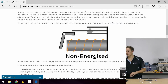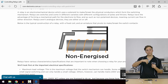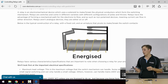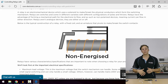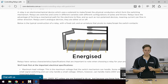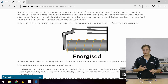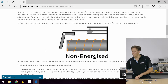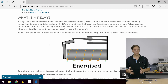A relay uses that principle - you can see a working description in the tutorial where the coil is energized and it has an armature which is attracted or pushed away from the coil depending on how it is set up. When it's energized it will make a switch, and when it's de-energized it will break that switch and could make contact with another switch. If you're not sure about switches, we've got a tutorial called 'All About Switches' that covers single pole single throw through to double pole double throw switches, which is terminology many relays use.